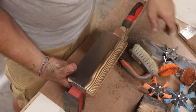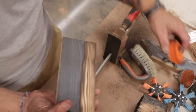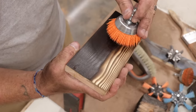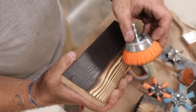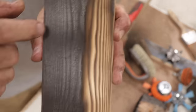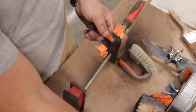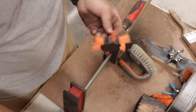Let's hit this with the cut brush and see what the difference is. Good enough for right this second — I just want to show you guys. You may have noticed that I was holding that thing at an angle. You can tell by looking at the brush that it's only dirty on the edges — I didn't go to the center. If you hold it flat down, not only is it going to wander all over the place, it's going to create some really crazy crosshatch patterns. So if you hold it at a bit of an angle, it's going to be able to get inside those grooves a little bit better. But even then you end up with these sort of circular marks. I'm always going to go back to these flat brushes — I like the way that they go with the grain and actually pull stuff out from in between a lot better.